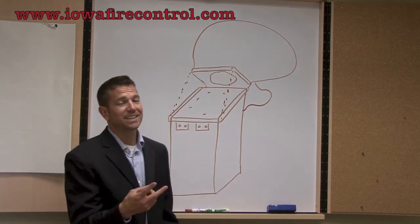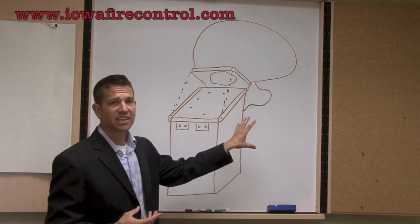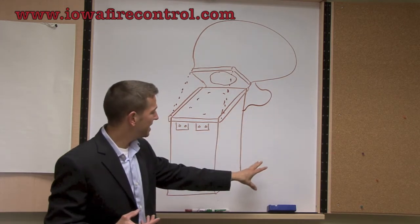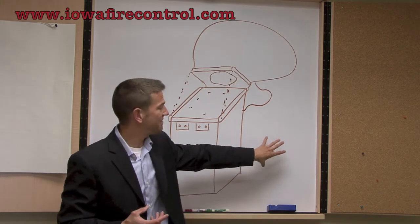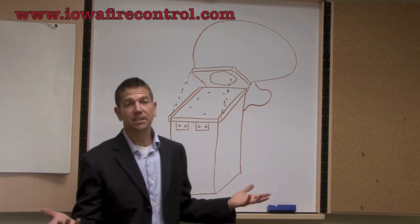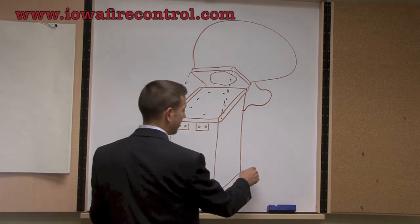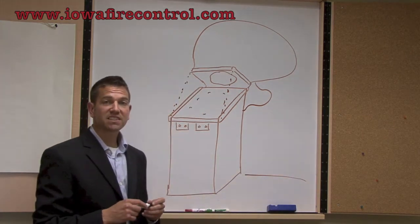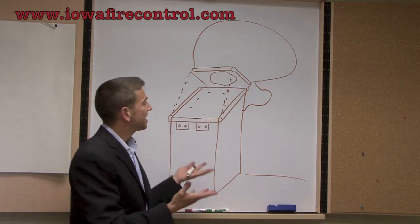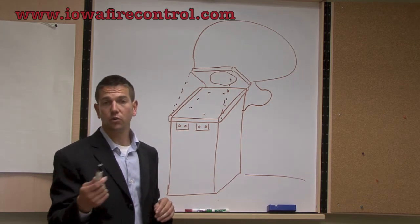But the second thing that's very, very important here is that if this fan isn't on a hinge, and we do have cable enough to take this fan off, and maybe for years upon years we've been setting that fan on the side over here, what I would ask you is, what problems do you foresee happening if we don't have a hinge kit on that fan? One thing for sure is that this roof area right here is going to have a chance of getting a hole in it. If we're throwing the fan around and it's got jagged edges, sharp edges, screws, things like that in it, then we're going to damage the roof, year after year or quarter after quarter when we're doing the hood cleaning.